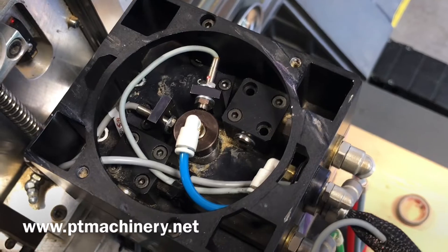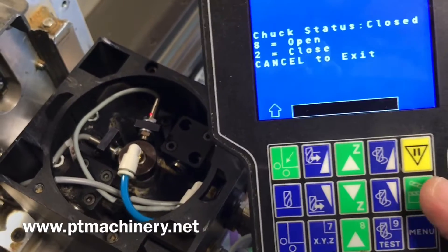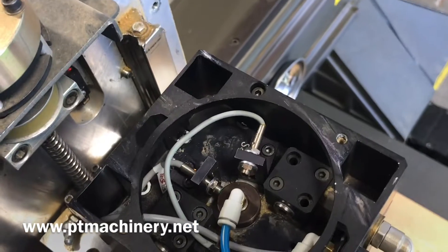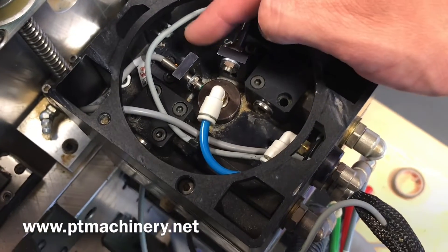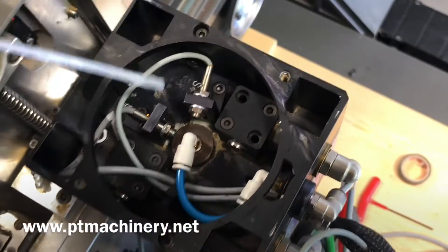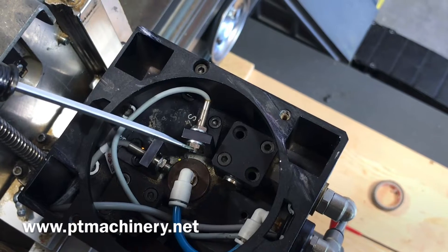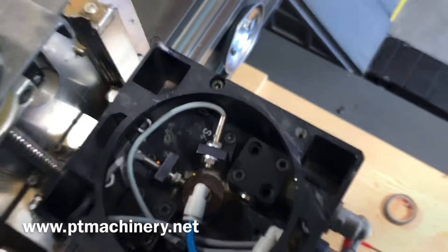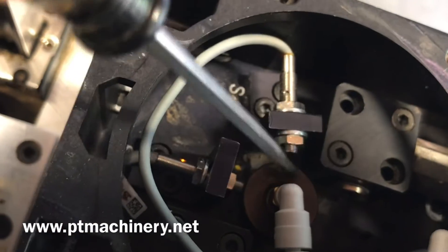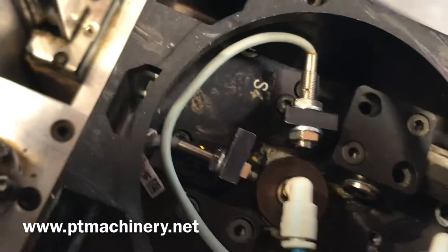Now I've got the new sensor in place and run through the machine. We're going to hit shift five — it's going to ask me are you sure you want to open, and we're going to say yes. That plunger moves down and out of the way. So now on this S4 position sensor, I can check it's now moved down to that other sensor position. All that plunger is doing is moving a disc of metal up and down. You can see — if I zoom in — as soon as it gets near the metal, the sensor turns on; when the metal is gone, it goes off.